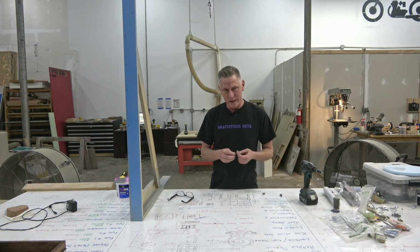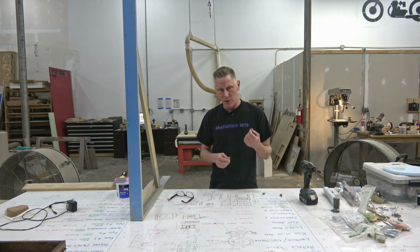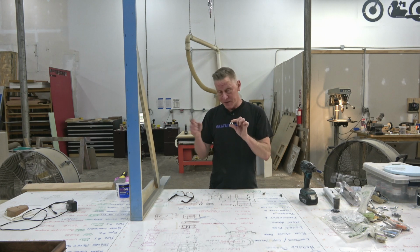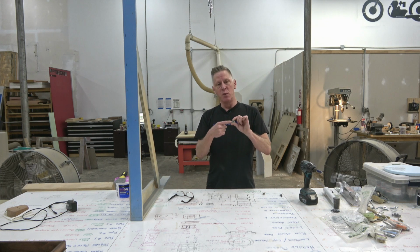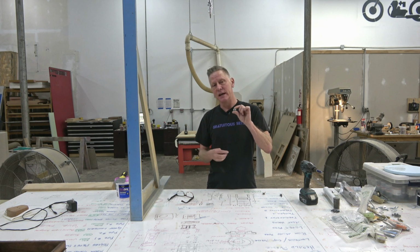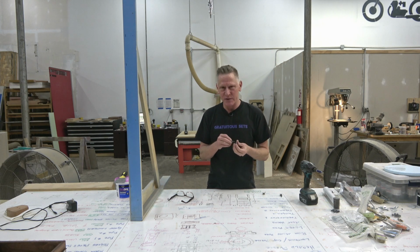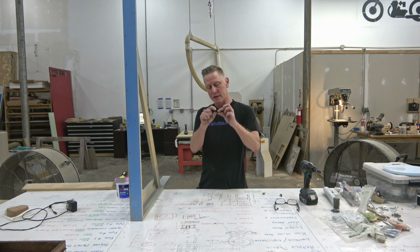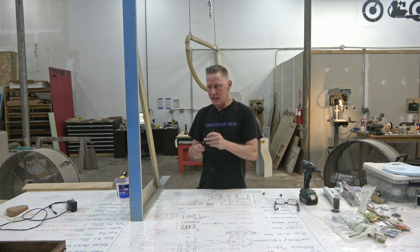To put a set wall together, generally we use a 1 5/8 or, even better, a 1 1/4 inch drywall screw with what we call jack washers, because they're made specifically for this purpose. This is a 3/4 inch outside diameter, 3/16 inside diameter washer, which is a bit of a strange size, but you can find them easily at Home Depot and Lowe's.